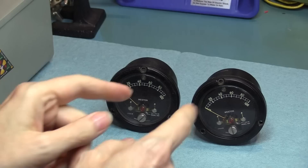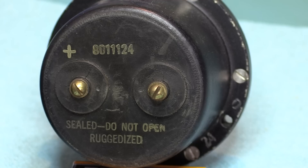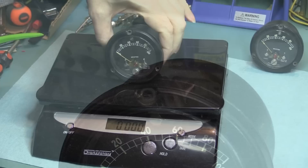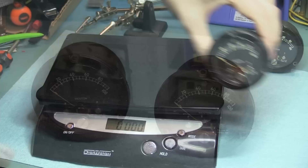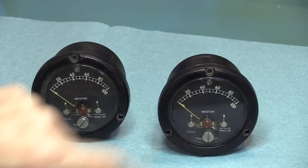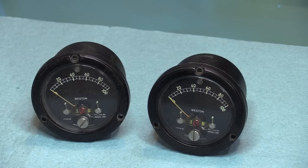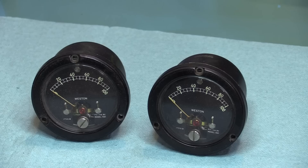Why is this? Well, the indication on these obviously military-designed Weston meters is found on the back: 'Sealed. Do not open. Ruggedized.' These are completely sealed, and they're not only completely sealed — they're also extremely heavy. 270 grams. Pretty beefy for a small meter. There's also a very thick leaded crystal on the face. These were intended to be sealed, put into any environment where power could give out or had to be read at night or in the dark. The emissions from these meters are greatly cut down — it's only the strongest gamma rays getting through that shielding.